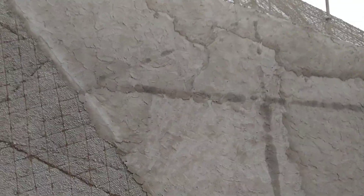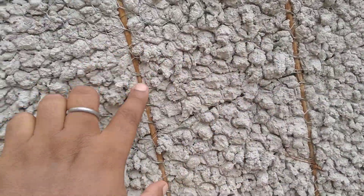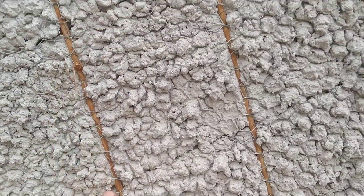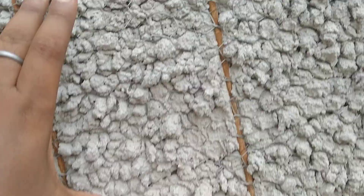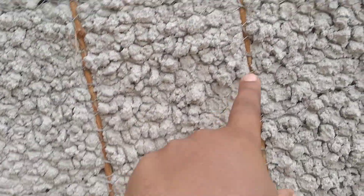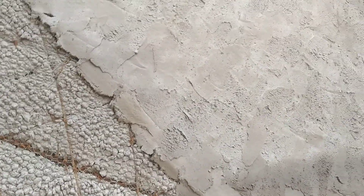This is a wall panel from inside. On this particular panel I will show you two types of casting — one done from inside and one done from outside. This section is done from inside. We have used 6mm bars at 150mm center to center — from this end to this end, it's 150mm, which is around 6 inches.